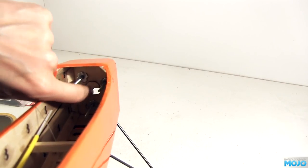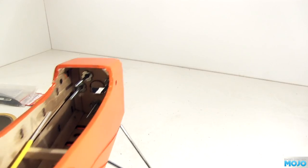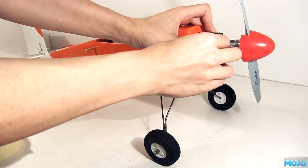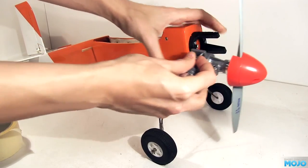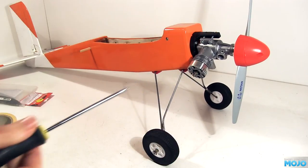When the mount comes off again, I'll pop a few drops of thin cyano around the nuts. It'll soak into the wood and really bind it all together. Next step, the bearers need to be drilled for the engine screws. Mark the holes. On some mounts you can get quite a good mark just with the pointy end of a self-tapping screw. Whatever you do, do one side, mount the engine using the first holes, then mark up the other side. It'll guarantee it all fits.